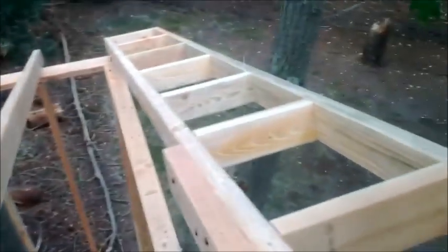You can see I got this first rake edge on, and as you can see from the lower one too, the rake edges run a foot beyond the side wall, because I want the soffit along the bottom here — you can see where my foot is — to come and wrap around the sides. Up here we've got the clerestory wall. They project up a foot to create a foot soffit, and then they run out a foot, and that same soffit's going to run down the side, along the bottom, and wrap around this whole plane of the roof.